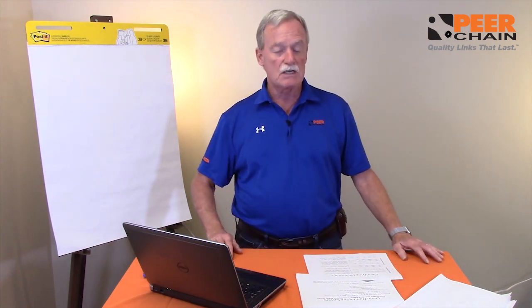That's the only one that goes back and forth because when you start talking about critical dimensions of the chains, we're always going to be worried about the pitch — the distance from pin to pin. We're going to be concerned about the distance between the sidebars of the roller link and the roller diameter. Those are the three basic dimensions that you need to know.